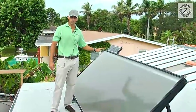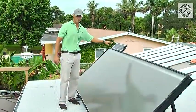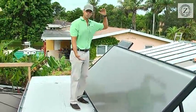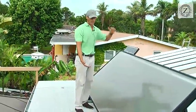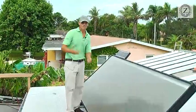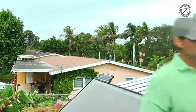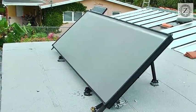This is a solar thermal system for domestic hot water. It circulates via a photovoltaic pump, circulating water from the bottom to the top and returning it to a hot water tank. This idea has worked very well — using the rays of the sun to heat water for your house, mitigating the demand on the heating element in your hot water tank. Using the solar thermal here is the same idea. As of right now, I'm integrating the solar thermal for pool heating, and it is very possible down the line to integrate it for domestic hot water as well. For the last 92 years, the standard solar water collector has proven to work.